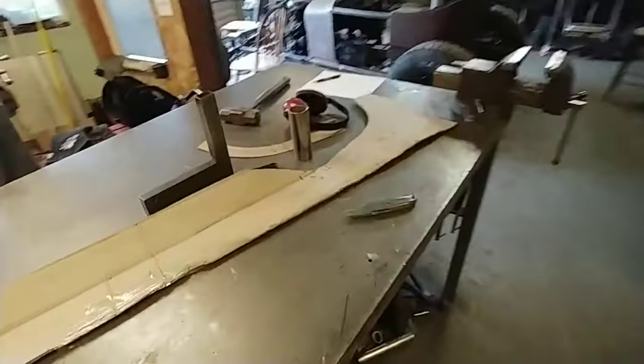So, all day yesterday, well, maybe not all day, all I got was two bends and a chunk of tubing and two brackets. Kind of sad, huh? Well, that's what it takes, though. But the nice thing about the two bends, they're in the correct spot. And that doesn't always happen first off. When you're bending tubing, you don't always get perfection on the first go around. But you know, I made a good pattern here, following my pattern, and I got the car to look at. So all right, pressure's going, let's get to work.